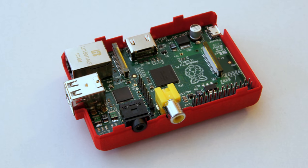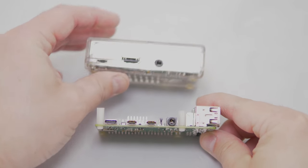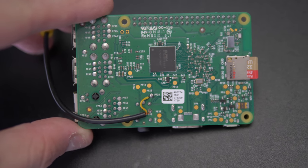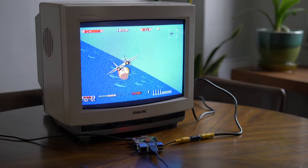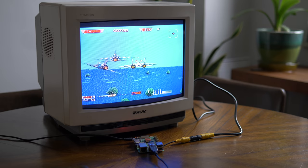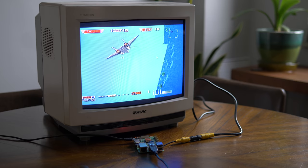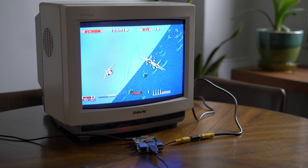First is about as basic and easy as it gets — simply use the Raspberry Pi's composite video output. Original Raspberry Pis have a composite port, and later models use a 3.5mm custom jack. You need to make sure to use an adapter that's compatible with it, or just solder directly to the Pi's composite video pads like I did here. I just soldered signal to PP24 and ground to PP6, and now this Raspberry Pi 3 has a custom composite video output. Depending on the hardware and software revisions, you either need to add some custom lines to the config.txt file, or simply leave the HDMI port unplugged. More detailed information is available on RetroRGB.com, linked in the description. Composite on a CRT is a perfectly good solution, and if you're just starting out, this might be the easiest way to get started.